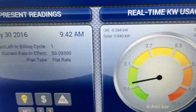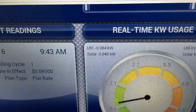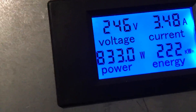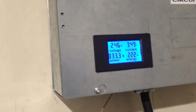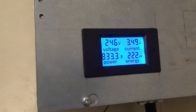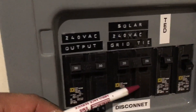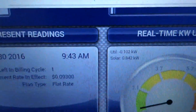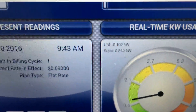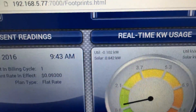So you can see here it's 9:47 in the morning and my power is climbing — it's 840 watts — and this display is climbing proportionally, showing 832 watts. So again it's about eight watts off between the two. They're pretty close — 833 versus 842 watts. The TED unit and the eBay meter are monitoring the same circuit coming in, which is why they track so closely together.